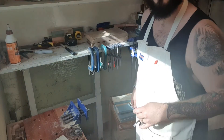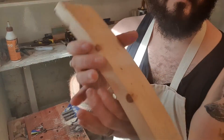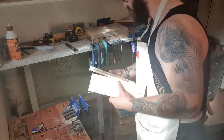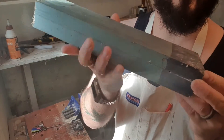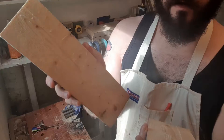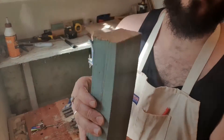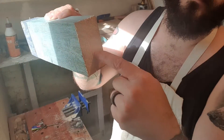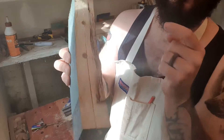I need a better thing situation for my cans, don't I? So I cut my wood in half. I have a big two by four — these are used wood. I just go right down the middle. I use a circular saw for that, going from one side. It only goes about halfway, a little bit more than halfway, so I have to flip it over and follow a precise line on the other side.